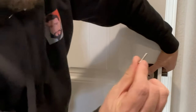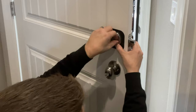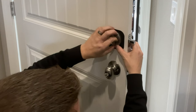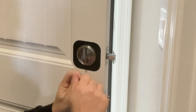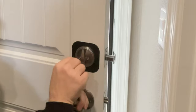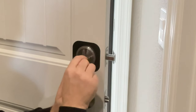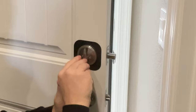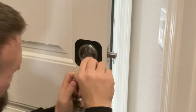You can see here we got the long bolts — we're just going to slide them in here until they line up with that other piece. The trick is just to get them perfectly straight — you're going to have to use the ones that came with it because they're the only ones that will fit. You might have to back them out because if they start to go crooked, it's not going to line up correctly — there's very little room for error. You go a little bit snug on one, a little bit snug on the other, kind of walk them in back and forth, all the way until you get them tight. Then go another half a turn and you know you got it.